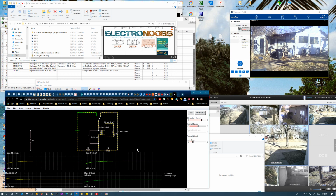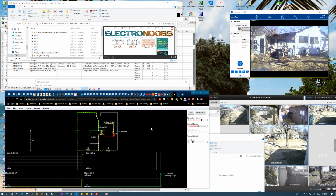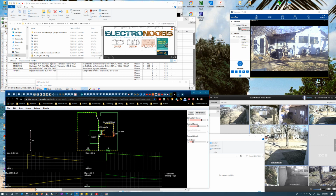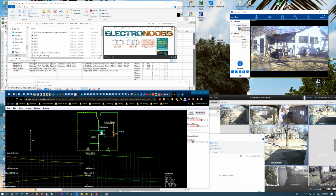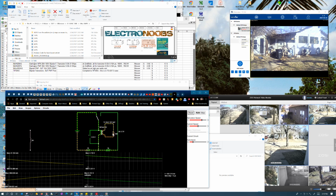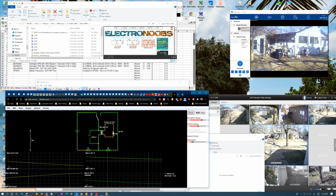But anyway, to make a point here, this is actually bearing out one part of the theory that I had last night. I was saying, I'll bet you if the impedances are equal, this will take up the current, and it does. In other words, you allow this inductor to fully charge once you switch. I was just a little surprised about the charging action, but when you switch off the charger, this does behave like I thought it would behave. In other words, we had 5 volts discharging at 50 milliamps or whatever, just like I would have expected.